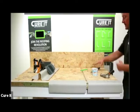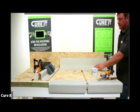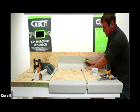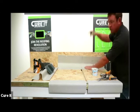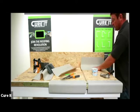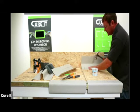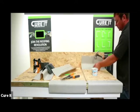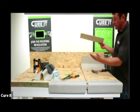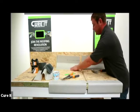On the back here we've got the D26 trim. Same as always, we're going to make sure we push it up and get it nice and secure, but we're also going to cut that detail trim along there to allow that 25mm gap, so that break runs all the way through. Using your tin snips, we don't need to secure the back with any trim adhesive at all - that's just going to fit where it sits. We're going to push it up tight leaving that gap, then fix it down to the deck. Depending on which way the water runs, you're going to put in your back trim accordingly. We'll show you which way to overlap the tin just to stop any build-up of water and prevent anything tracking back in between any joints or seals.